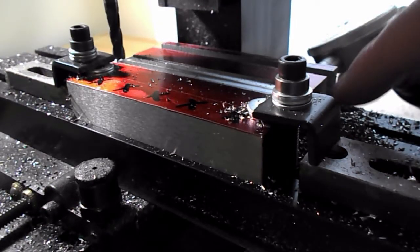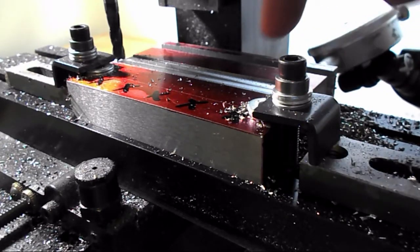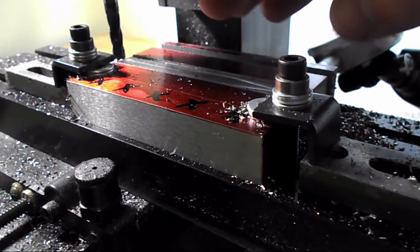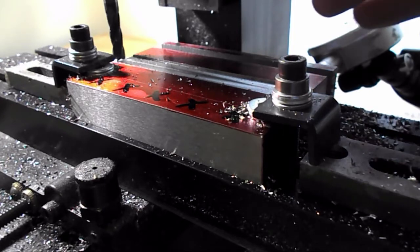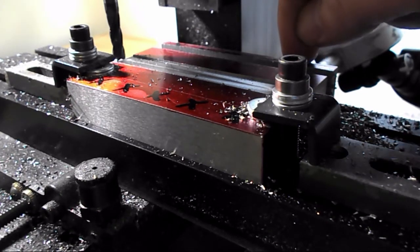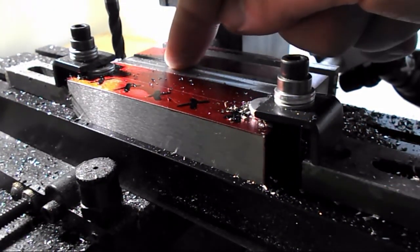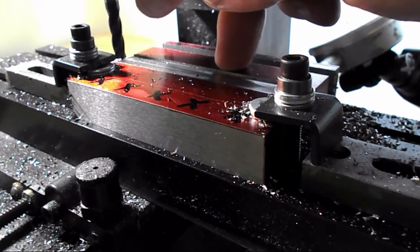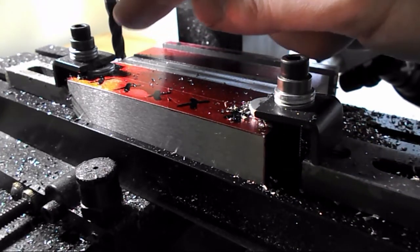I finished the spot over here and I'm actually going to attempt to slice off this big chunk with a slitting saw. Now I'm going to start cutting the center section away. All this milling I'm doing is just roughing right now — I'm going to rough this out, cut this off, rough this out, take everything out, deburr everything, measure everything, make sure it's where I want it to be, and then go for the finishing, because the final result has to be precise. This cut is going to be 60 thousandths deep. This is A2 tool steel — that's a quarter-inch carbide end mill — and I'm going to go full width all the way down and then conventional back up the other side.